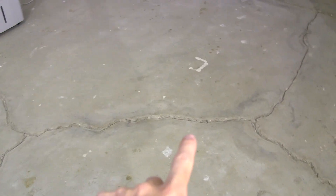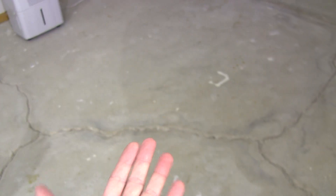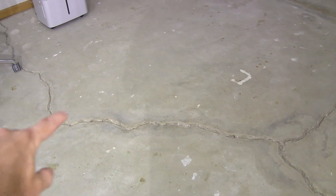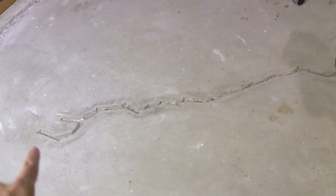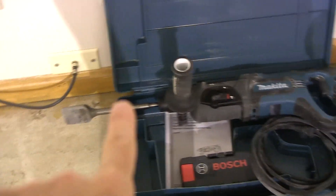I pulled out all the carpet. What I suspected was that I did have some cracks in the floor. The cracks weren't originally this big — these have been chased out so I can seal them properly. The cracks were due to either heaving pressure underneath or the curing process; when the slab was poured it might have been a hot day and cured too quickly, creating slight stress cracks of maybe a millimetre or an eighth of an inch. You can see stains where water has come through them.